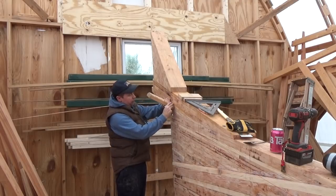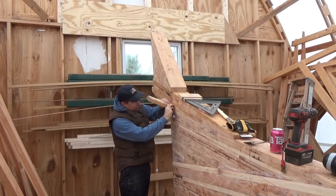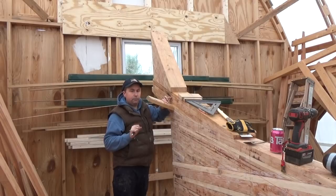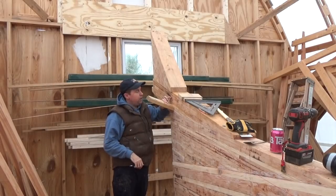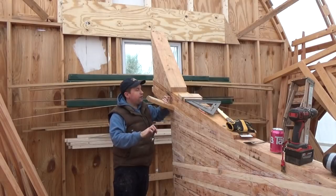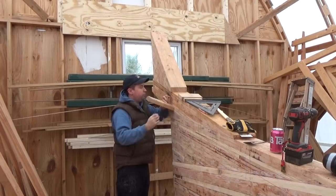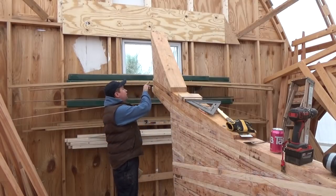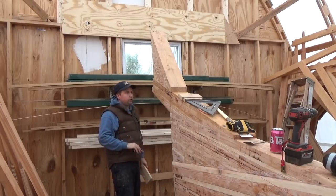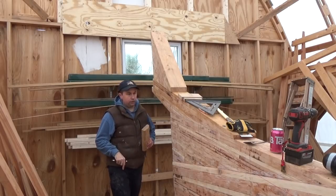So I just took a 2x4, since my finished hull planking is going to be 1.5 inches, and cut it to the flattest angle indicated in the plans, because we can always steepen it up. Cut it to the flattest angle that we'll use as a general guide for the bearding line. And then we can cut the rabbet out. But today, I really want to dry fit the transom that we completed and just see how it looks and make sure everything lines up. So we're just going to mark a couple bearding lines, and then we can hopefully get to the transom.